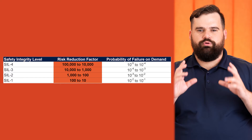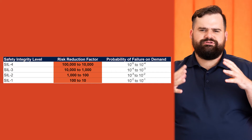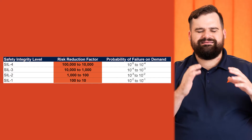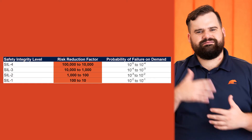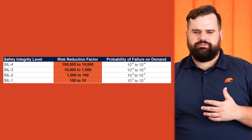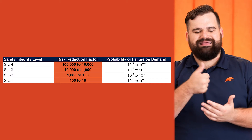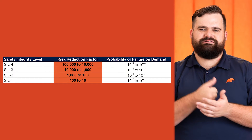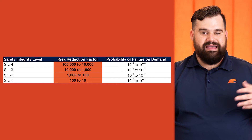There are factors for how you make a SIL device more reliable based on inspection, testing, and how you design it. What's important is you need to have this in calculation form to use it. But all this tells you is the reliability of the SIL device — it doesn't necessarily tell you whether the device is going to fix the problem. You still need to make sure the action it's taking is going to address the scenario in the PHA before you can take credit for this device.